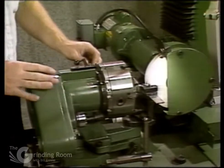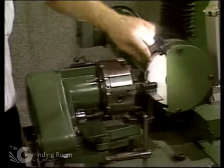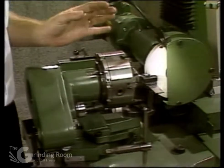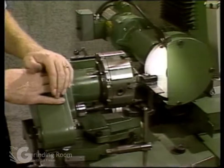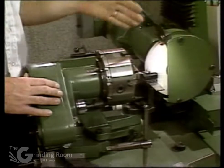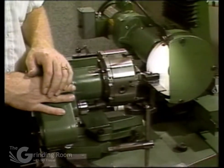If you do want a slight amount of undercut with this method, you're going to have to use a dish or cup wheel that's recessed on the side — you don't want a flat side on the wheel when doing this type of work. If you're doing a 180-degree included step, you have to use an undercut wheel, otherwise you'll be grinding the side of the pilot when grinding the step. There's no way to eliminate the problem of the radius with the grinding wheel at 180 degrees.